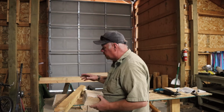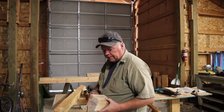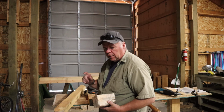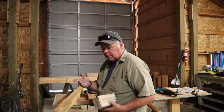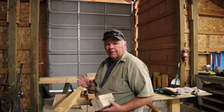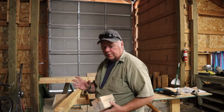and all of my material, all the timber frame material, has been cut on that sawmill since I've owned it. But the first blade came, and the first blade on it had a 5/8 tooth. That means it was 5/8 apart. And I bought a batch of saw blades. I bought an extra 5 because I knew that the standard is between 3 and 5 logs is about what you can cut with a saw blade. So I was going to need extras.